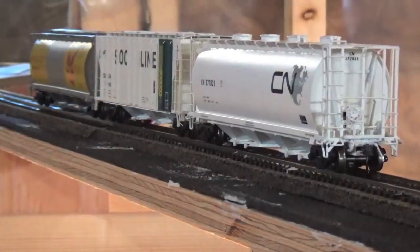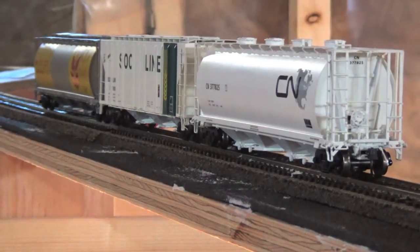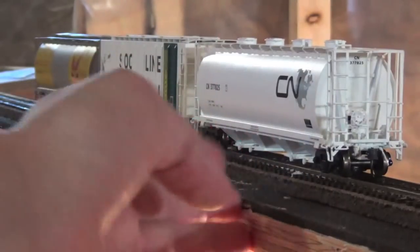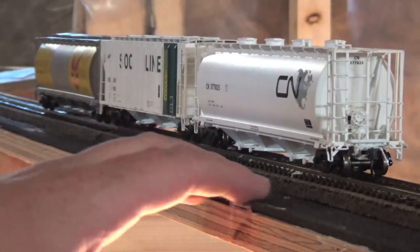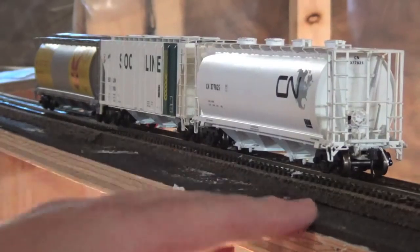I think this experiment was worthwhile. I did use silicone to secure the rubber to the plywood and then the cork to the rubber, so that extra layer of silicone could also help with noise dampening. However, silicone doesn't seem to stick to the rubber very well, so I'm going to use something like No More Nails instead. I'll be ripping this up and sanding it down to redo it properly.